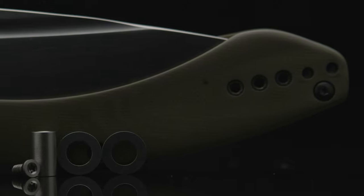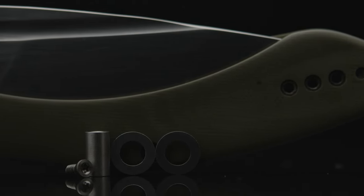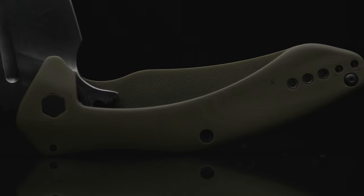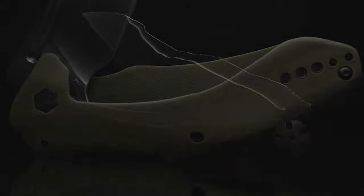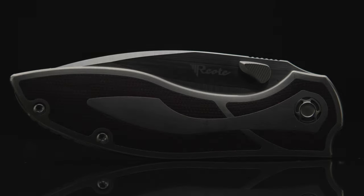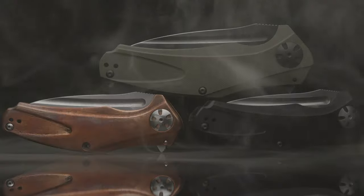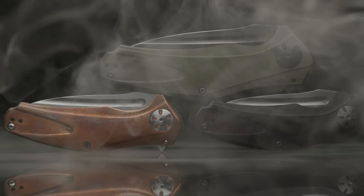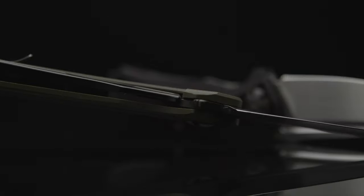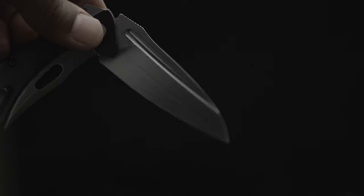This also presented itself as an opportunity in my eyes. This was the first lock I could completely drop from the frame, not only get a real understanding of its function, but fine-tune the pressure it applies to the blade. It's allowed me to set an action that is on par with, or even superior to, some of my $300 knives. But everything in the build works on tolerance — you may achieve a nice action by moving a lock bar, but the detent may be too loose and limp to fire, or it may not be pushing the blade over. But as you can see, all these builds are dead center and true. The lockup is solid, but the buttery action is there.